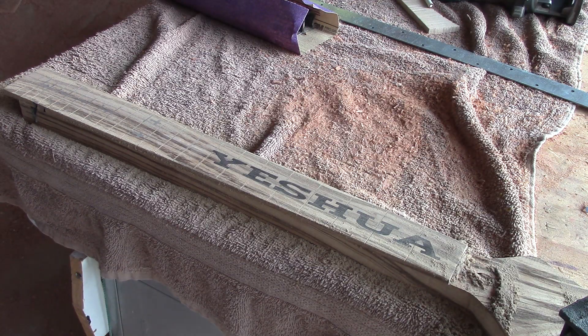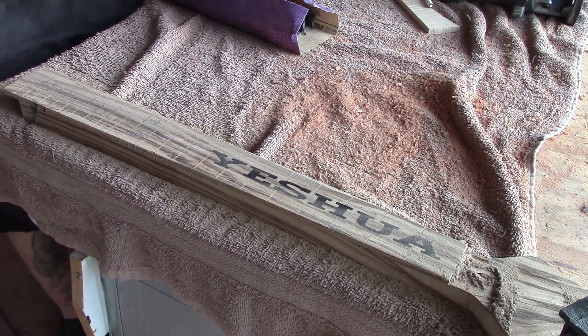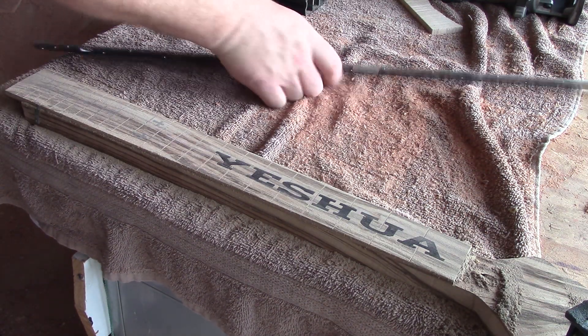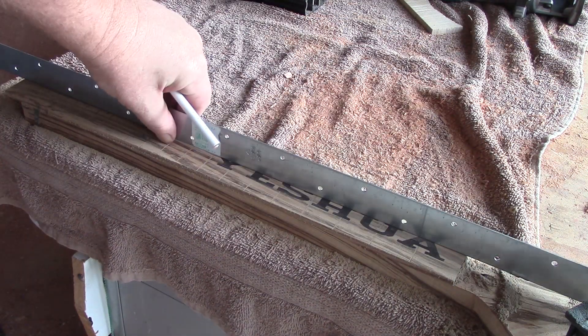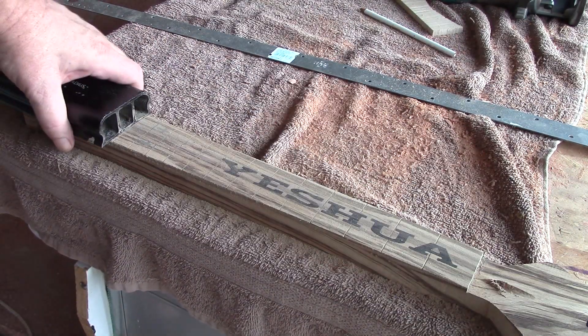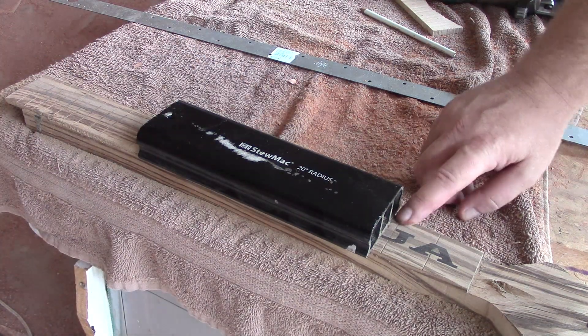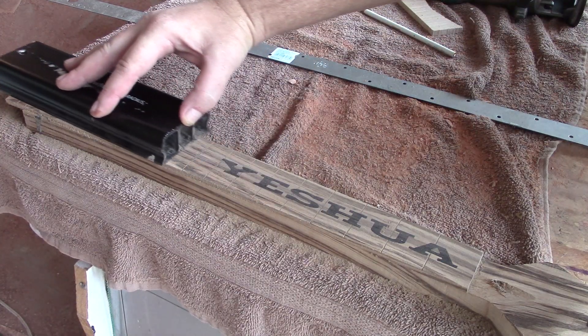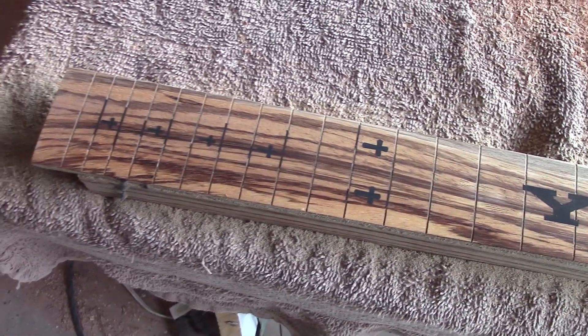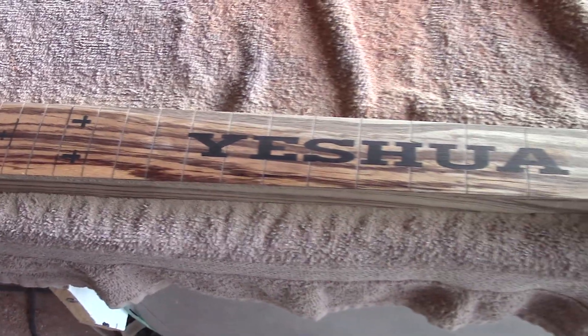One thing about it — that zebrawood, man, it really is easy to sand. Even though it's such a hard wood. The one thing that I do the most while I'm doing this radiusing is checking to make sure it's good. Take your time. Check your fretboard with your radius block. Look at it. Get down in here and look at it. Run it down the fretboard and see what's missing. Hold it like that and look at it. See if you got air, see if you got any dips in there. I'm thinking that thing's looking pretty good. Next time you see that, that'll be on Acoustic Guitar Jamming.